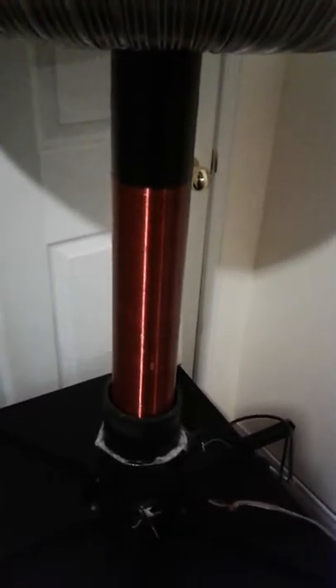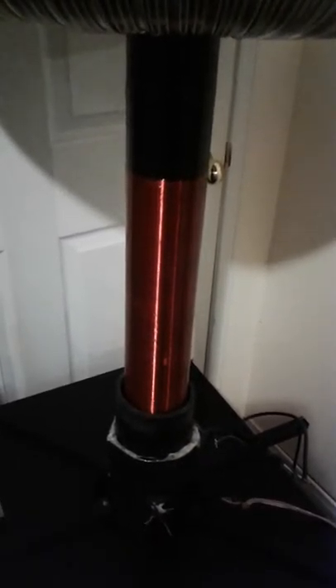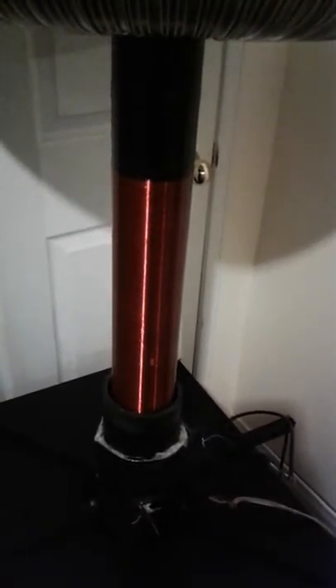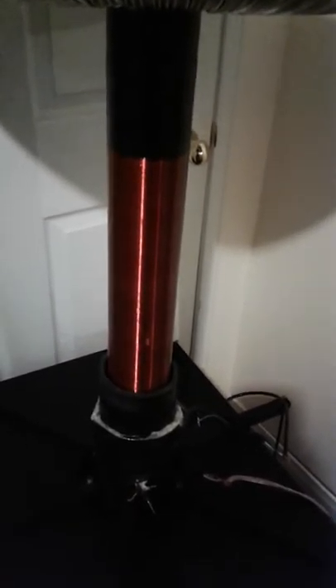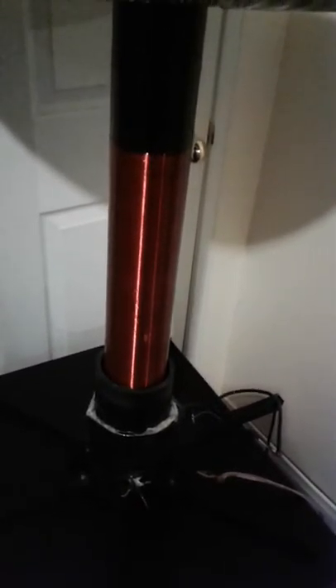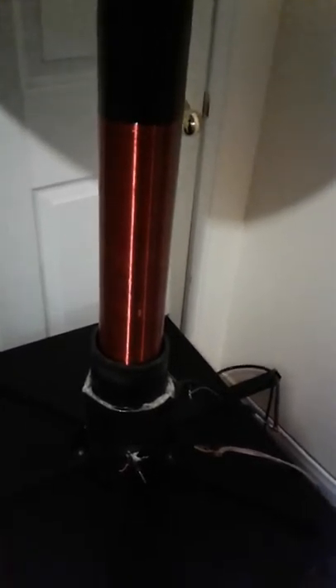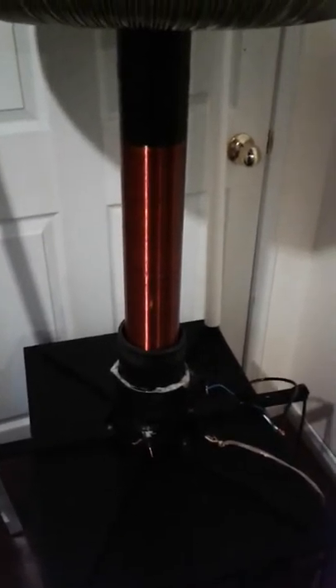It's really good to have a coil completely wound with no joints — that way it's completely tight together and there's no chance of arcing between the coils. Remember, you're stepping up the coil thousands of volts in every turn. It can be 500 to 1,000 volts between every couple of turns when you're vibrating these things, stepping up the voltage to hundreds of thousands, close to a million volts or more. So you want your coil to be really tight and wound straight, no overlapping.